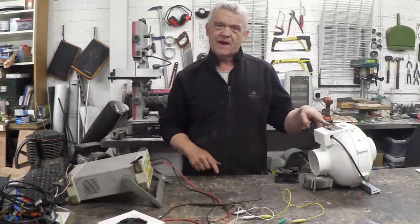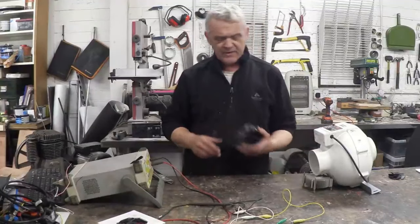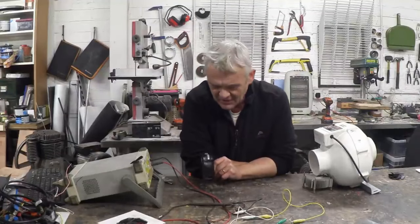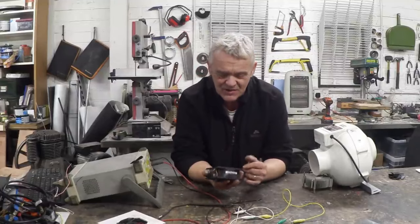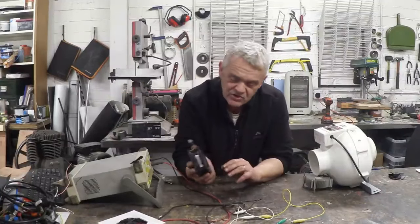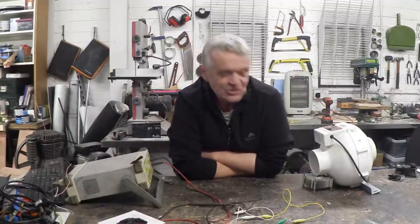I've got a mark on the bench from this fan, and when I turn the fan on its single setting, at that point I measured the wind speed at 3.5 meters per second. So I take my fan that's been altered to be a generator and stick it there — you'd expect it to generate, and it does generate. The problem is what it generates is actually quite embarrassing — it's ridiculous, it's in the sort of micro-amp level. It spins but generates next to nothing. This is an 80-millimeter fan; if you use a 120-millimeter fan you can get it to light an LED, but with the 80mm at that wind speed we can't. The usual explanation is that fan blades are designed to pull air in, not to extract energy out — so don't expect great efficiency. That seemed reasonable but was seriously disappointing, because it's so easy to do.